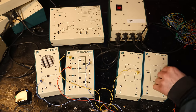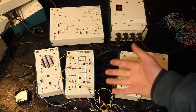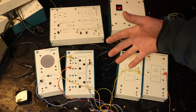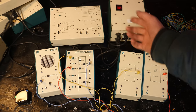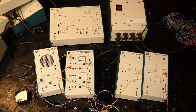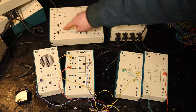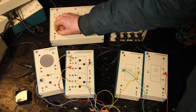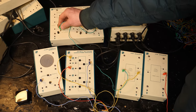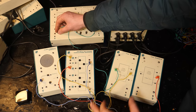We're going to plug the output of the modulator into the speaker — and it's really high. So this is the beat frequency between the two oscillators. If you look at oscillators by Brüel & Kjær, for instance, you'll see they're called beat frequency oscillators — because there are two oscillators inside beating off each other. A theremin also works on a very similar principle. Now we're going to slightly adjust one oscillator's frequency using a voltage offset — plus and minus five volts — so we can adjust the beat frequency between the two.